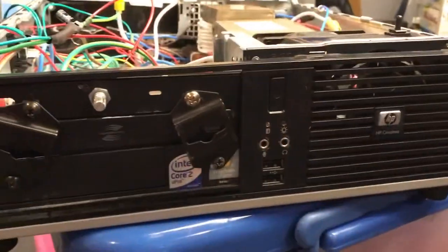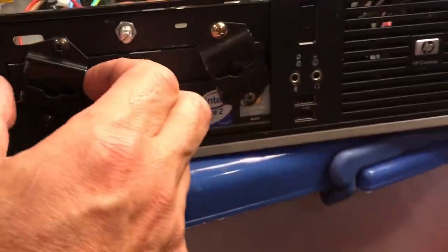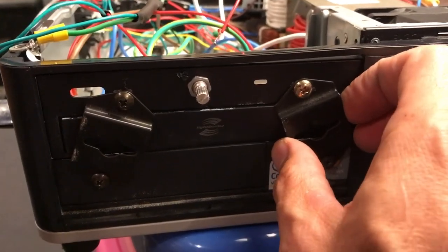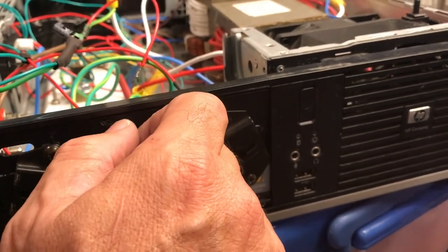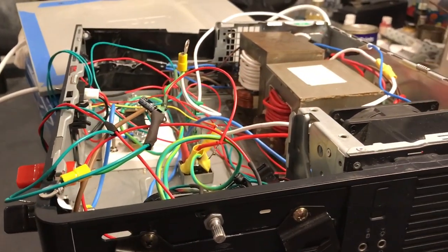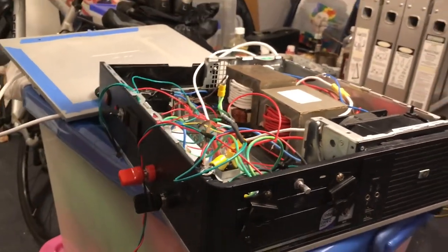On the side of the case we've got brackets that came out of a microwave - a little tribute to the microwave, and how useful those screws from microwaves have been along with our rewound transformers. That's how we're going to set our voltage to 13.8 volts. By this weekend I will either have a pile of smoking garbage or a 20-amp linear supply for the shack.